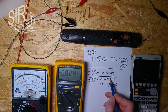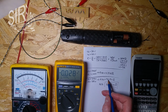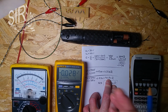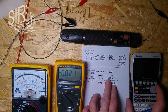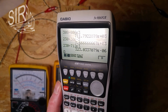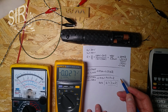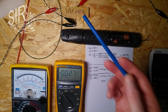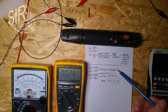And yeah, I don't want to have a system in my home supply system with an isolation resistance of such a low value, because that's a risk. Because if I calculate how much current would flow through to Earth or to the person that connects to the badly isolated appliance, that's a value of 323 microamps. So yeah, it probably wouldn't kill you, but it's definitely not the current you want to experience. So yeah, I call this a full success. It's not an absolutely accurate measurement device, of course, but it's capable of testing if a system is well isolated or badly isolated.